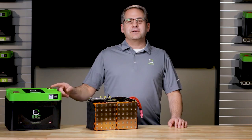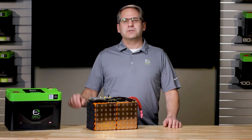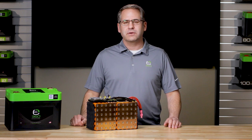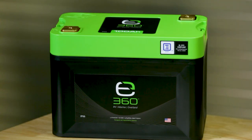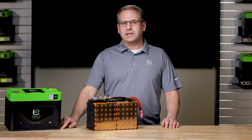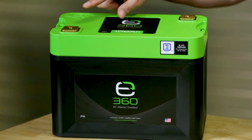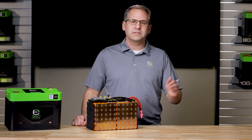The Xbeyond 360 battery case is constructed of fiberglass infused ABS, or thermoplastic polymer. It features custom no-slip tie down points to ensure all internal battery components stay in place regardless of the orientation the battery is installed in. The corners are purposely rounded to create strength and absorb shock. The bottom of the case utilizes rubber feet to reduce sliding and vibration if the battery is installed right side up. The battery connection terminals are oversized brass pads symmetrically placed so that batteries can easily be configured in parallel or series.